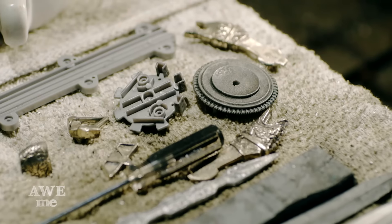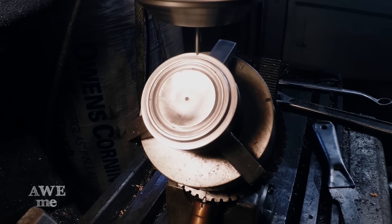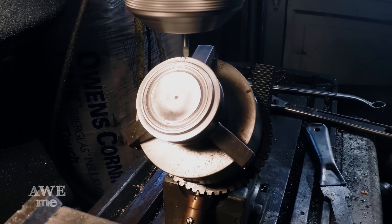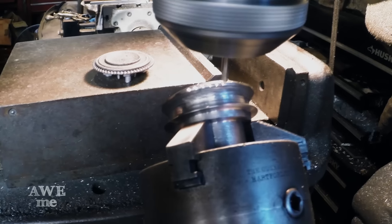The circular center section of the bow has small indented cuts all the way around the outside. I take a tilting indexer, set it in place, use a tiny cutter on the milling machine, and go all the way around it cutting each one of the small indents.